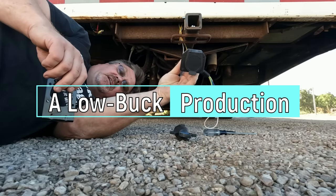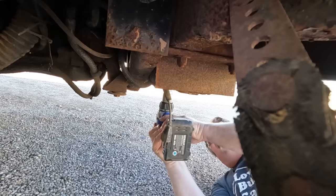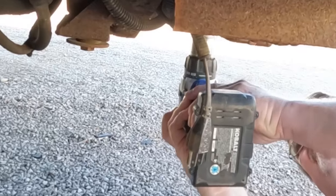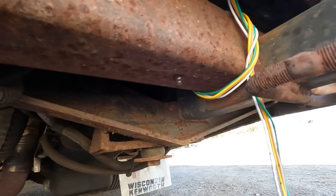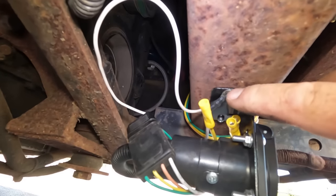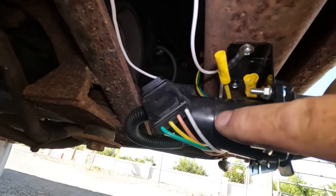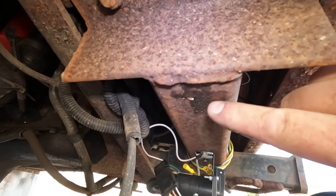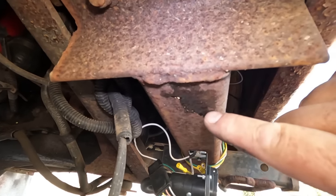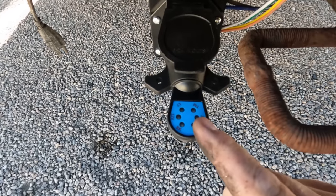Now that I know this bus does a great job towing, I'm going to go ahead and install this trailer connector with its mounting bracket so I can use my car trailer when I want to. Apparently that hitch was full of water — I guess I need drain holes. I drilled drain holes on either side of the tube so it won't build up water again. Brackets in, attached the additional ground, plugs in — it's hooked up to the flat 4 connector, so I can unplug it if I want the flat 4. And if I do need a brake controller, I can hook it up easy. Got my hazard lights on, plugged in the tester — everything is working fine, so we're ready to go.